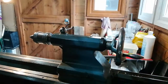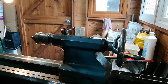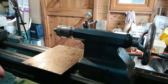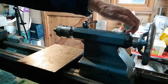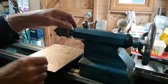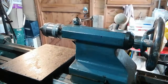Let's have a look and see if we can do it here. There's the tailstock, and we're going to try to safely eject the live centre without causing any damage to the machine or the centre. First, as usual, we always put a protective cover over the area of the machine bed to protect it. When we can't turn the wheel, we'll lock it into position. I've turned it now so the quill is completely retracted — there's hardly anything showing, just a bevel and a flat surface all the way around, which we're going to use to eject it.